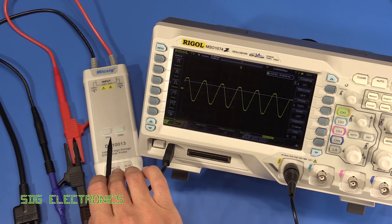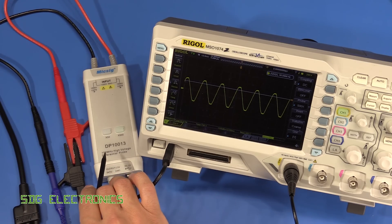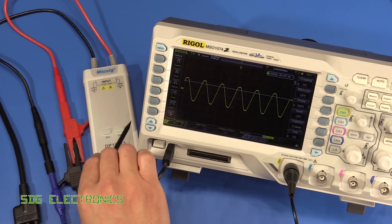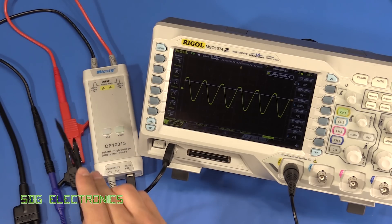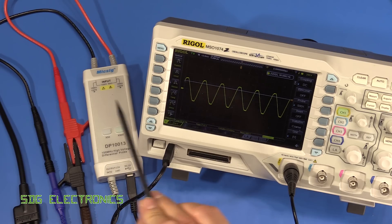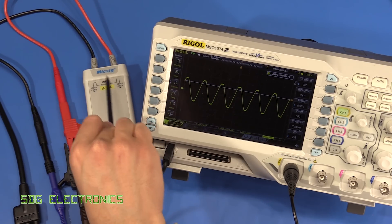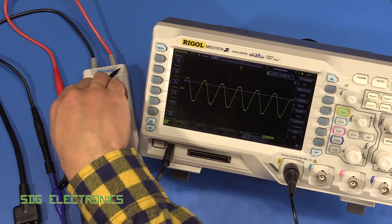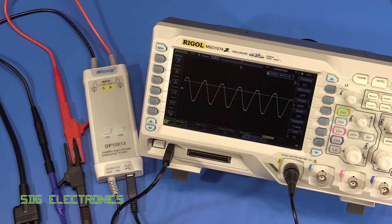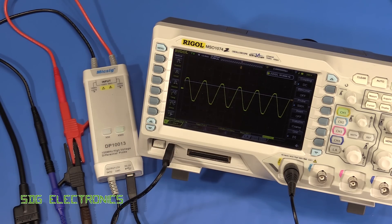There are some limitations you need to be aware of. It's advertised as a 100 megahertz probe — the minus-3dB point is at 100 megahertz — and almost certainly the electronics inside is capable of that, but the leads here are fixed. That long lead length means you're never going to be able to probe a 100 megahertz signal and effectively measure it on your oscilloscope. It is a slight shame that the leads are fixed, but you could open it up as I did and replace them with connectors if you need to do measurements at high frequency — for example probing a switch-mode power supply running at high frequency.